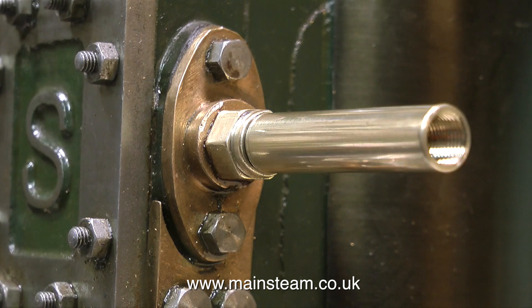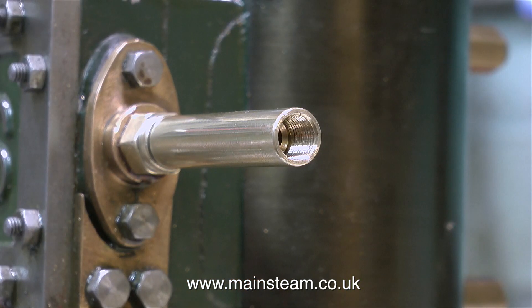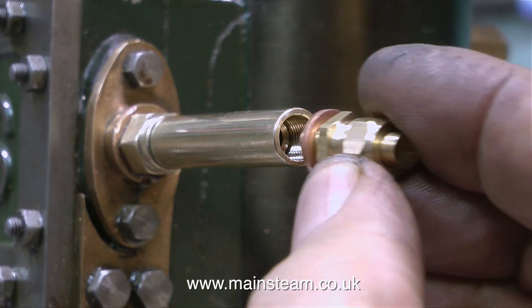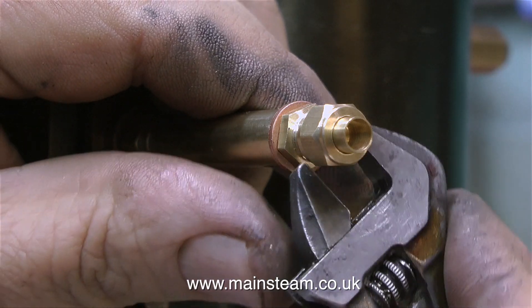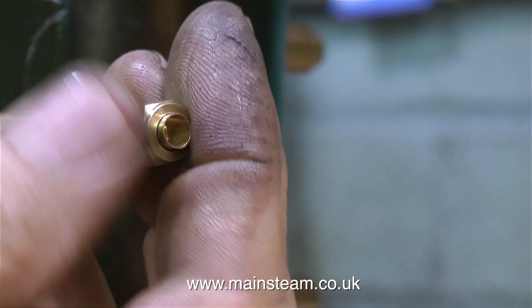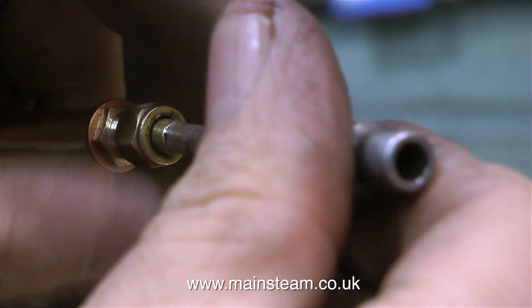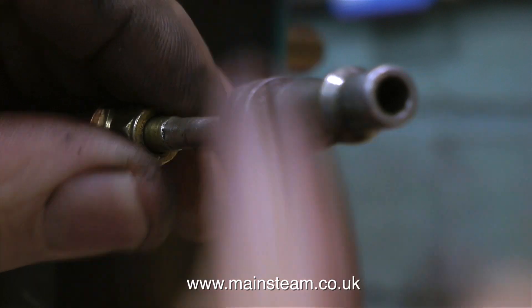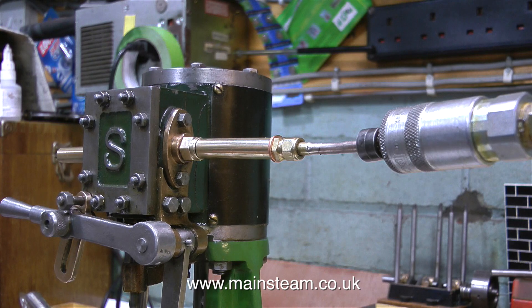This will be the steam or compressed air inlet pipe. On the exhaust pipe side of the engine, it's just a plain outlet with an internal diameter of 5/16ths of an inch, not threaded like the inlet pipe. The reason for threading the inlet is so I can fit commercial unions to it — this is a commercial 5/16ths by 32 union with a washer fitted. I'm temporarily fitting my silver-soldered union that connects the compressed air line to the engine, allowing a very secure and direct connection from my air compressor. And here's the engine running.